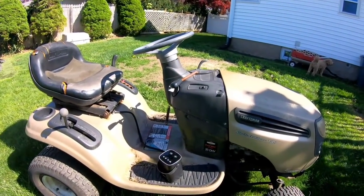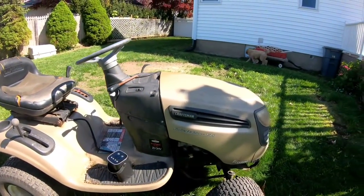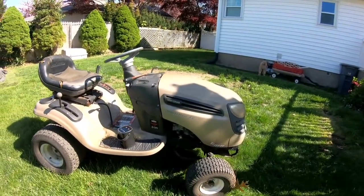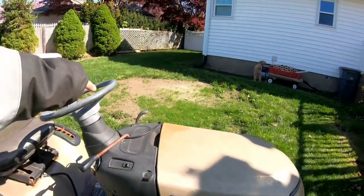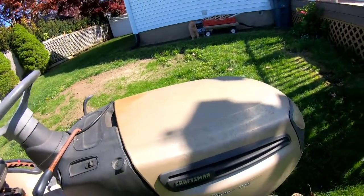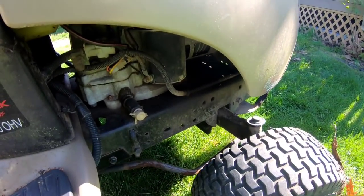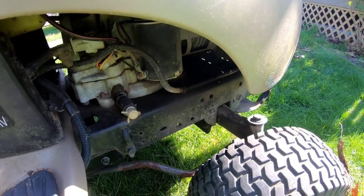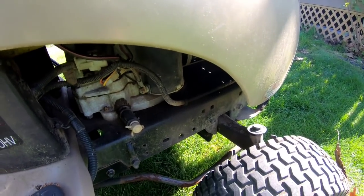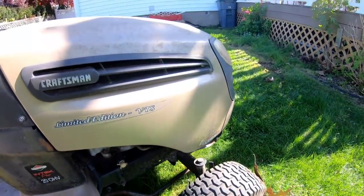I don't know, now I'm starting to think about it. It doesn't look that bad. Why am I taking the engine out of it, right? Everything seems to work. I could have sworn the steering was bad though. It's fine. You know what? I think it's because the guy replaced the drag links and he put it on backwards, which is why it bows out and touches the wheel. That was the issue with it.